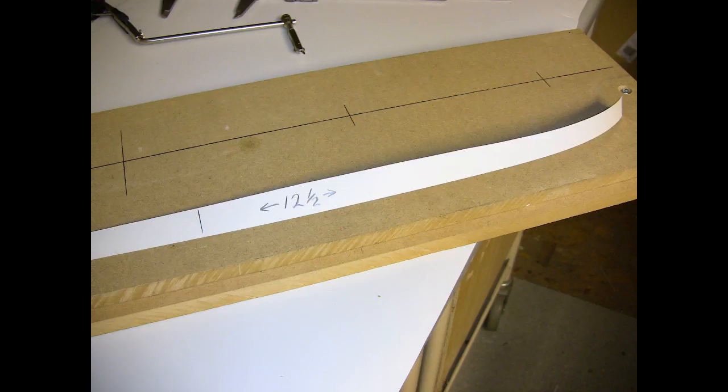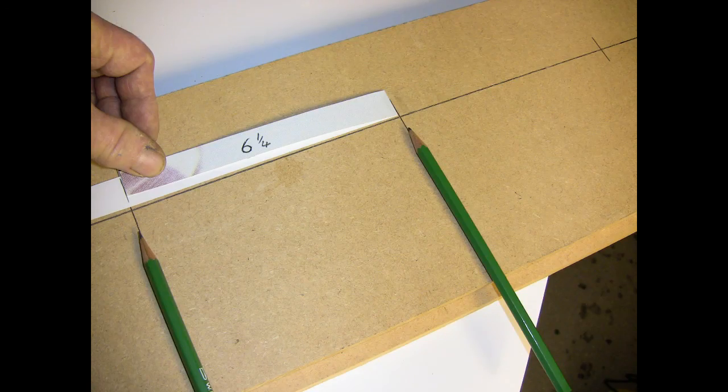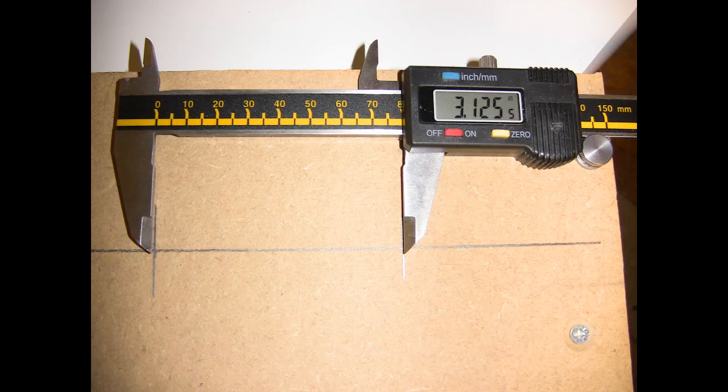Then we had to mark out the beam. Now this is very very critical — the measurements have to be as accurate as possible. So what did I use? A micrometer? No. A piece of paper. It's going to be 12 and a half inches long from the most outer pivots to the central pivot. Finding the halfway point of 12 and a half is very very complicated — you fold the paper in half, giving us 6 and a quarter. But we need to subdivide that again to get the position of the other pivots, so we fold the paper again. With technology like this I think we ought to be called Flintstone Engineering. As crude as it may look, you have a clean crisp pencil line to work to, and surprisingly 3.125 happens to be 3 and 1 eighth inches — remarkably accurate.